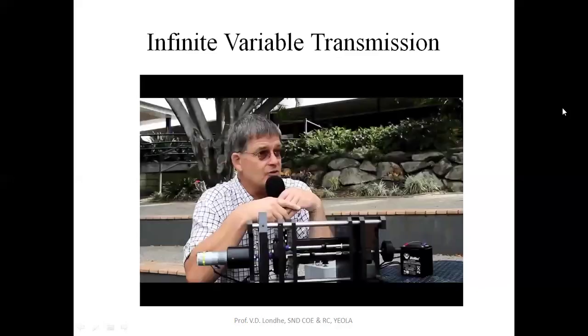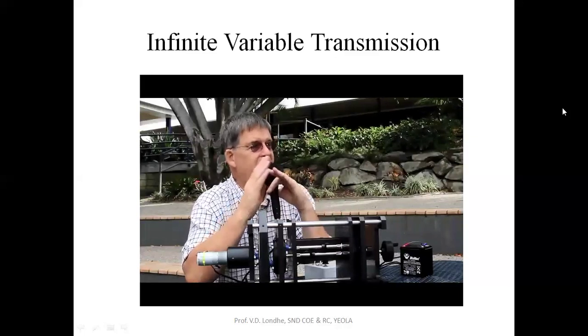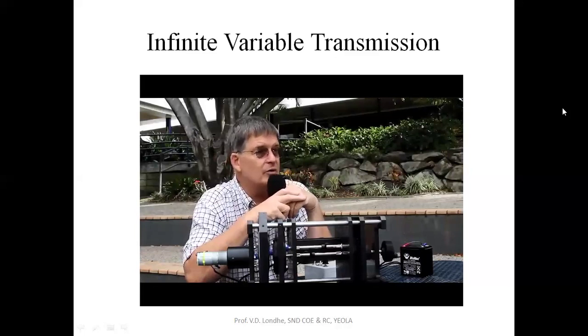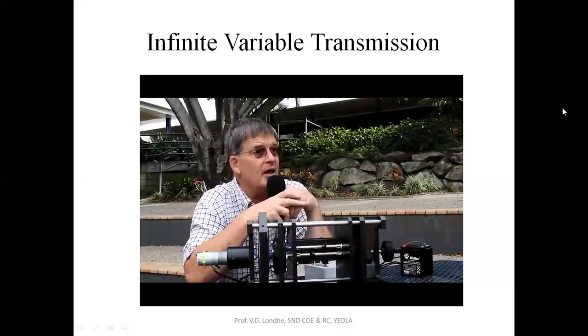It's not like a belt drive where you have a V-belt that operates between two pulleys that vary their size, or a toroid, which is a plate that operates between two curved discs. It is the pressure of the plates being pushed together, or the discs being pushed together, that causes the change in ratio, but at all times it is a flat surface pushing on another flat surface. This is why they're limited in the amount of torque that you can put through them.